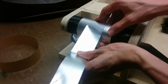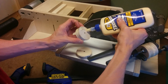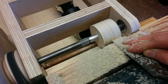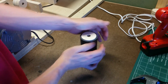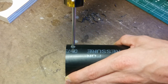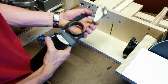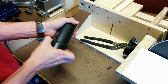To give the idler drum a bit of a crown shape to help with tracking, I'm just adding a few wraps of aluminum tape around the center of the drum. The driving drum is built just like the idler, but this time I'm using two end caps on each side just to give a little more surface area for biting onto the driveshaft. Since this is the drive axle, they don't get bearings — they're just a shaft hole — and I'm also fastening them with a screw to make sure the end caps don't spin when they're being driven. To give the driving drum some grip, I'm adding inner tube over the two-inch pipe. I had a hard time getting that inner tube to stretch over the pipe, so I had some help with a pair of pliers to kind of pre-stretch it out and then rolled it over the drum and was able to get it on that way.